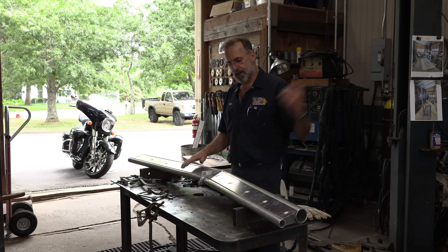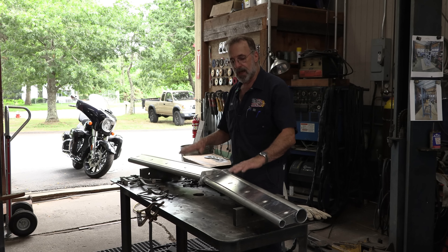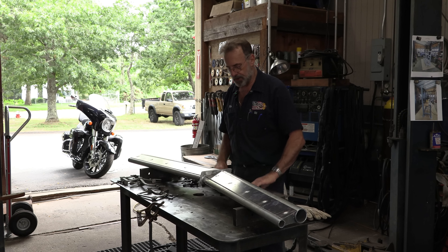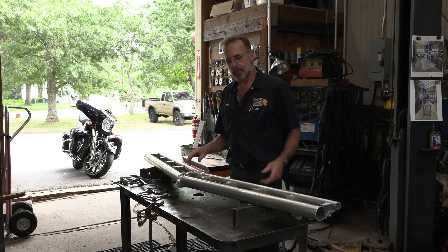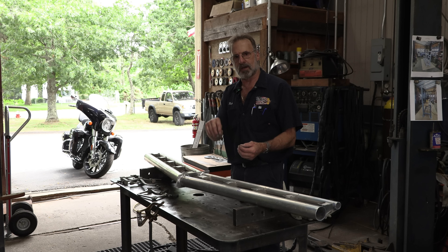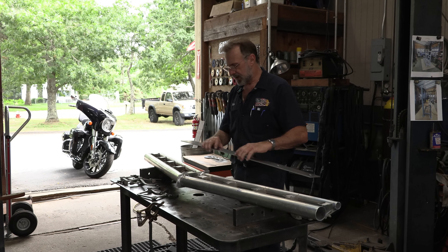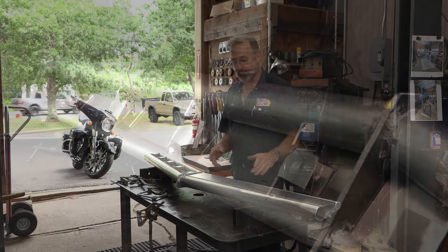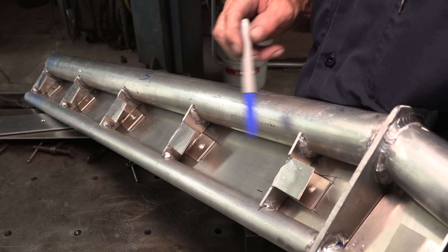I now have brought both spreaders — this is the second spreader, and this is the top spreader here. We've already completed the bottom spreader up to the point where the panels top and bottom are rosette welded on. Now I've got these two here to rosette weld on this side, and I want to bring you in so you can see the penetration we're getting on the rosette welds on the underside, and then we'll give you an example of rosette welding these in from the outside.